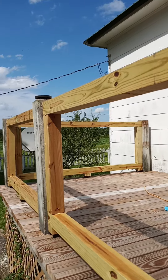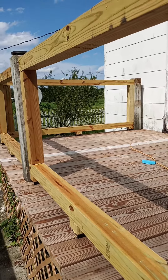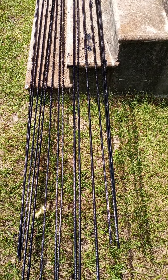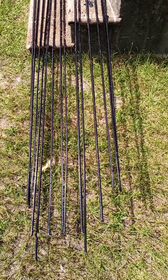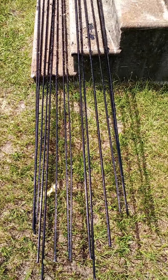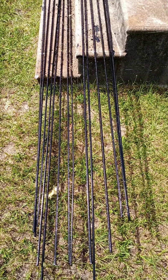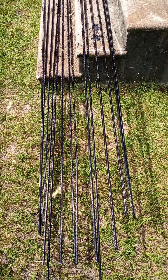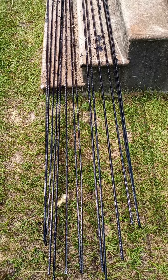I've got everything now. I've got some centerpieces to do and I'll show you what else I've got going on with them. This rebar will be going horizontally instead of vertically and I painted it, and I think I want to put one more coat of paint just to make sure I've got everything covered. I'll have to cut it with a cutting blade and a grinder and get it cut to length, but it'll be coming from both sides and they have to be spaced. I've got a jig to drill my holes and space them because you can't have them but so wide to be within code.